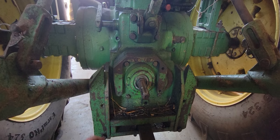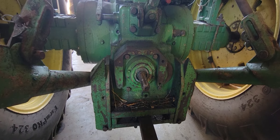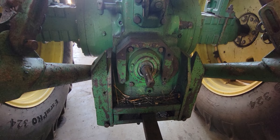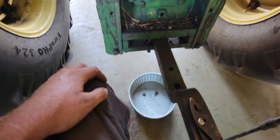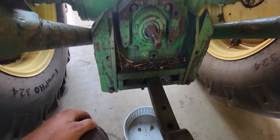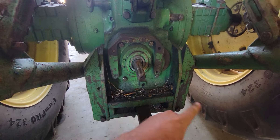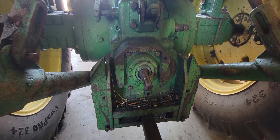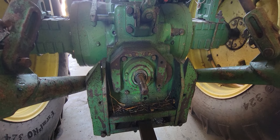The shafts go into different hubs in the back of the tractor to get your different RPM rating. I've seen guys ask how to do this, so I'm going to show you exactly how to do it. You're not going to lose the oil out of the rear end of the tractor — you'll lose just a little bit. So you want to throw a pan down on the floor if you're in the shop, or if you're out in the driveway you don't really need a pan because it's not that much oil. I went ahead and took some brake cleaner and sprayed everything off just to get some of the dirt off from pulling the combine home.